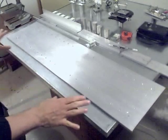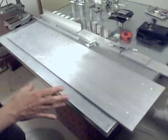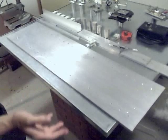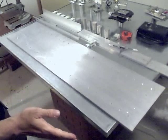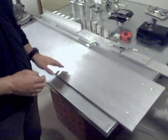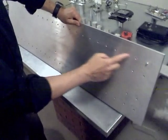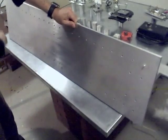What I'm showing here first is the optical breadboard. One of the most important considerations with an optics bench is that you want a very rigid structure to put all your optics onto, to minimize vibration. Quite often what is used is an aluminum slab, perhaps a half inch to three-quarters of an inch thick. I've got a slab here which has been cut to one by four feet and perforated every two inches with a quarter-inch hole. I'll just lift this up to show that a bit better — the holes go all the way down on the top, on the bottom, and also along the length.